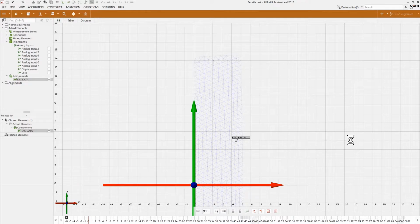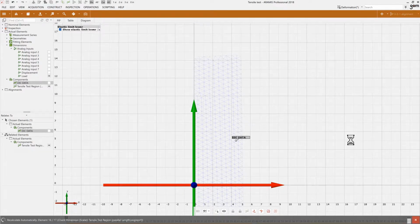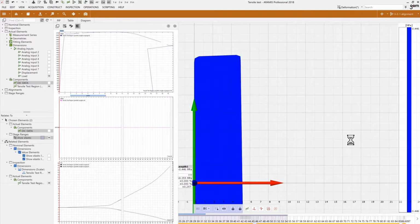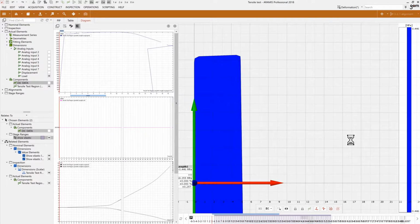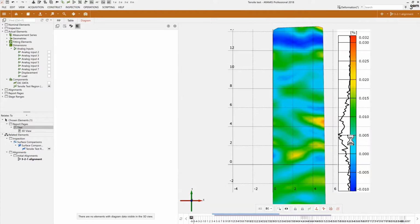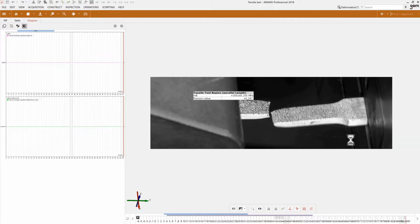All right, I'll go ahead and compute this, and this will launch the computations of the strain maps as well as the automatic definition of the best fit modulus curves and Poisson's curves using all of our pictures in this test. Again, that's a total of 150 pictures and a total of 500 nodes across the entire surface. Okay, so we start seeing some of those mappings showing up on the screen, and you can see on the left the software is computing a lot of data.